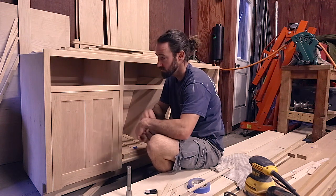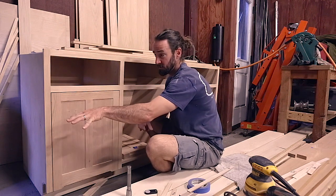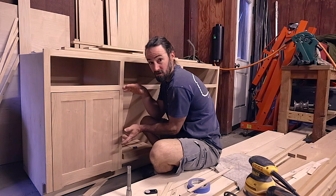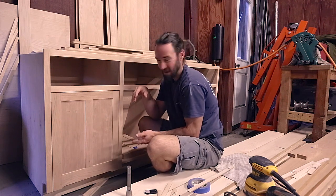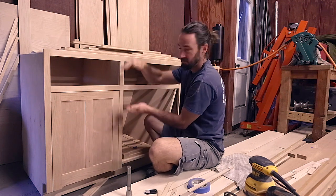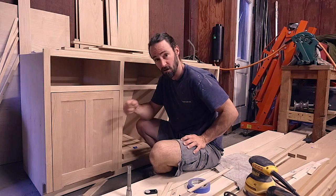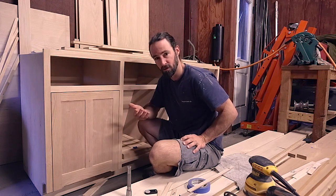I designed it in SketchUp, did the model exactly the size I wanted, and then when I ripped these pieces I just made them slightly bigger. The length also has to be 1/16 of an inch larger, or actually times 2 — which is 2/16 or an eighth — because you're going to have to make them a little bit taller to account for the increased thickness. So I went ahead and did that, just writing it down on a piece of paper when I created the doors, so I'd have a little bit of material to remove.